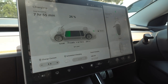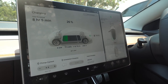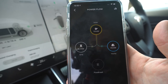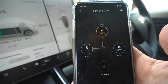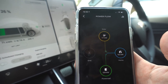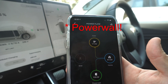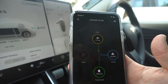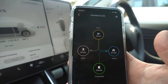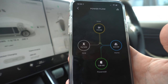We've just stepped it down to 8 amps — basically half the charging rate I can get off my three-phase system. Looking at the Powerwall app, we're using zero Powerwall right now. 7.8 kilowatts from solar, the house is now consuming 7.6 kilowatts, with just a little bit of trickle going to the grid. The solar has just dropped a little and house consumption jumped slightly, so it's now pulling a tiny bit from the grid — it's quite hazy and smoky here on the central coast so solar is fluctuating a bit. But overall a great result — using a mix of solar and Powerwall to charge my Tesla Model 3.